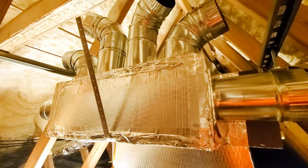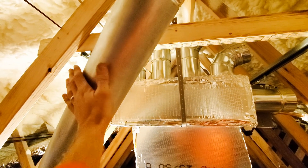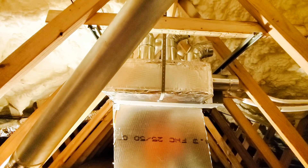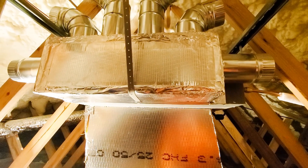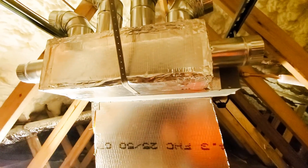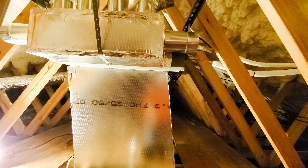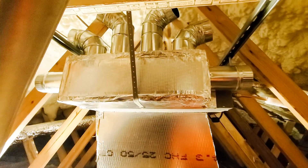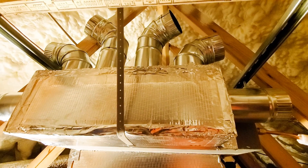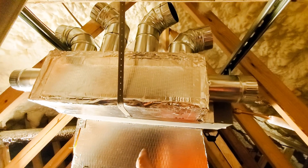Got the plenum put back on. This is the chimney pipe — it's been on quite a while and it's not overly hot. It's on level two right now and has been running all day because it's freezing outside. Before I had the plenums facing down to avoid hitting this pipe, but if I shot them down, all the pipes would come out and block either path on either side — I wouldn't be able to get above the living room. So I took the plenum off, turned it upside down, put the 90s on there, and now the flex duct will go up and then out.